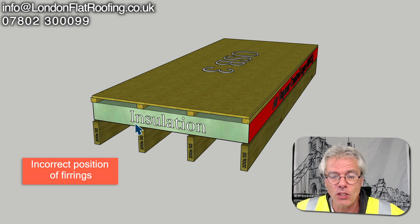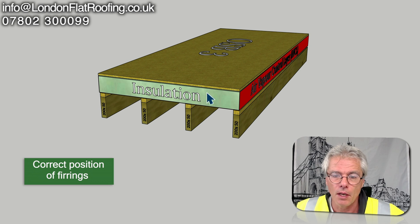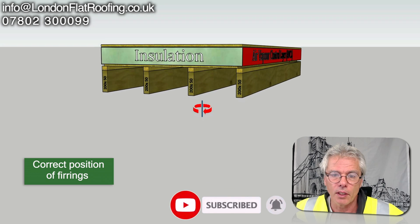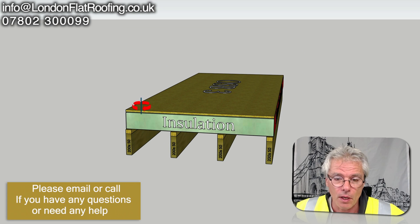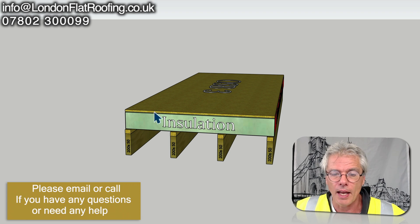The whole thing should be airtight from the vapour barrier onwards, so the furrings should go at the bottom and there should be no gaps above whatsoever. Let me show you the correct way of doing it. The sandwich is absolutely tight here — the vapour barrier is still the same, wrapping all the way around. You've got a lovely sandwich where your insulation is nicely sandwiched in between the air vapour control layer, and you do not want an air gap at the top where vapour that gets through could accumulate and cause a problem.